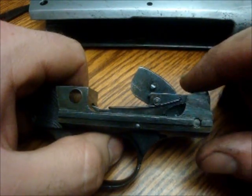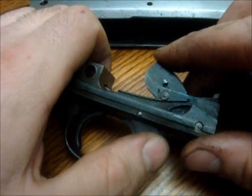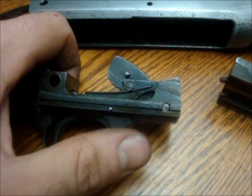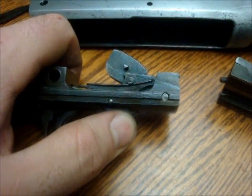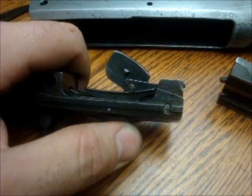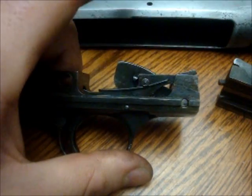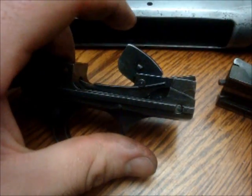So the way they overcome that is the slide release here. I guess you'd call it the bolt release, which is what, once you pump the shotgun, anyone who's used one knows that you have to push a button, usually around the trigger, to bring back the bolt, unless you fire. So getting back to this then, when you fire and you pump the gun, this will actually ride and lock into the bolt release. So as you see, if you push the bolt release, it'll come back up.